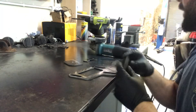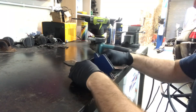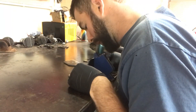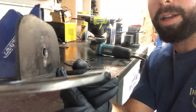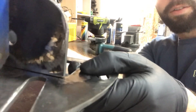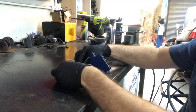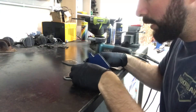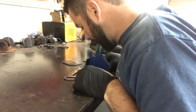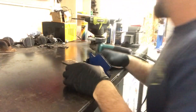Okay, here we go — we've got the first plate here. Take your magnet, set it up on here, line it up, and make sure you're nice and dead straight down the edge. And you've got the edges to line up as well. Now we're ready to weld on the backside. I'm just going to do a tack here and a tack down here. I'll also take this plate here and put it underneath just to keep it level — this is 4mm steel. Got that nice and lined up.